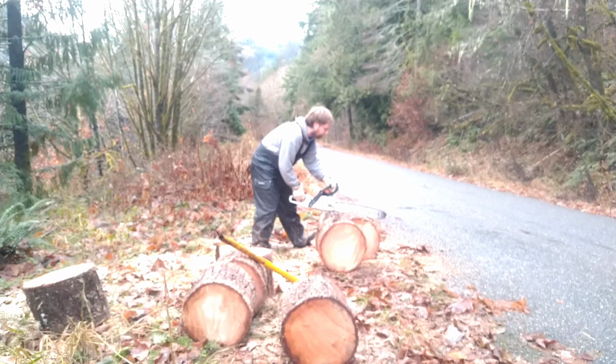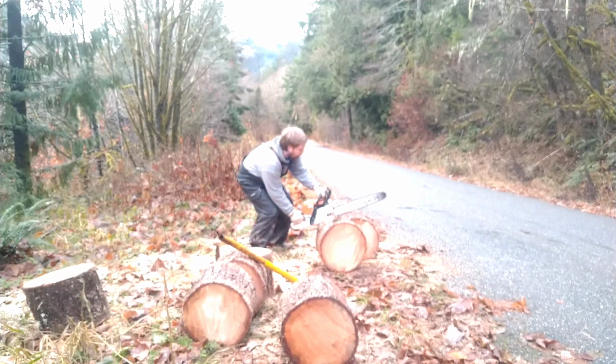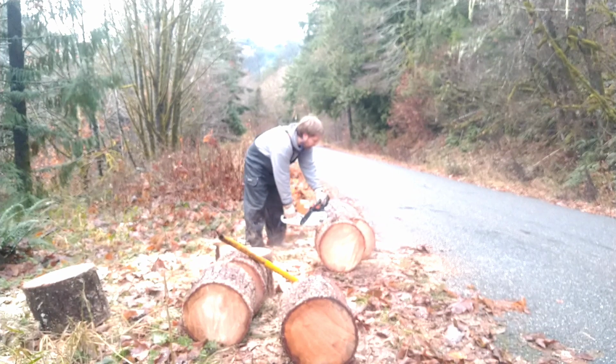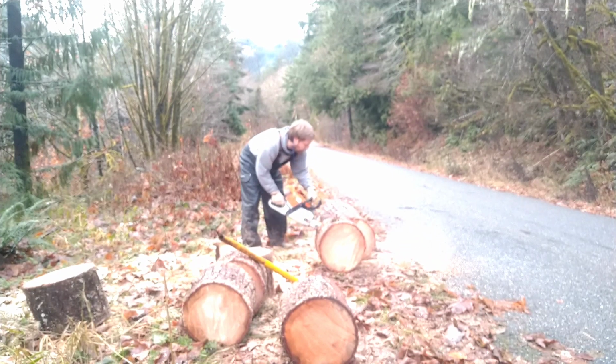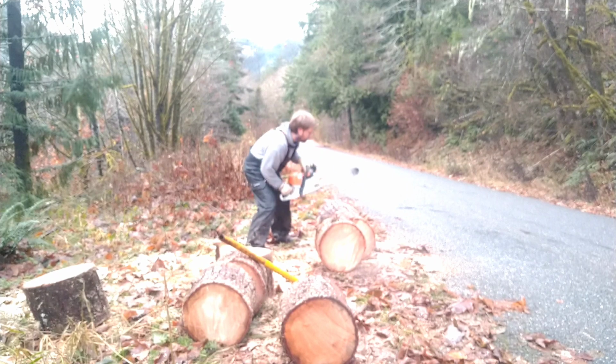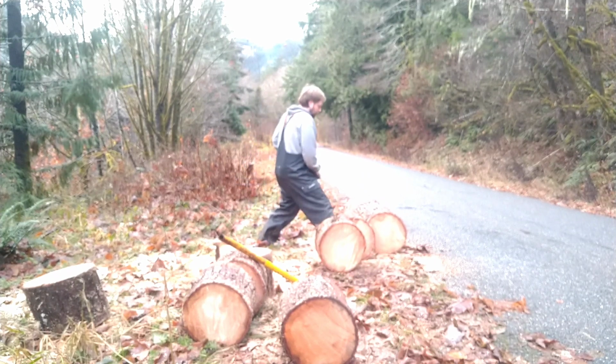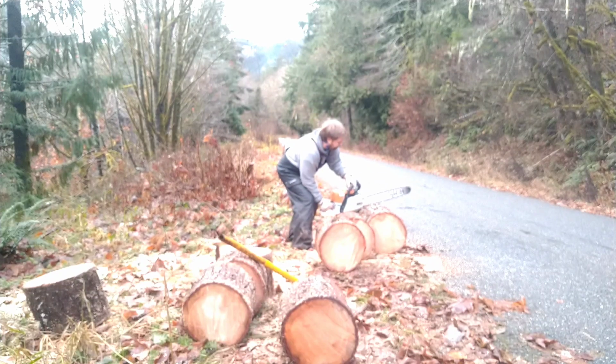One thing that I learned when I took my written National Park Service Chainsaw Sawyer's written test was that kickback occurs at the end of the bar. When you're using the meat of the bar closest to the power head, the chances of kickback are highly unlikely.